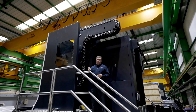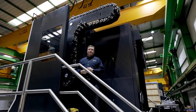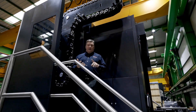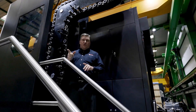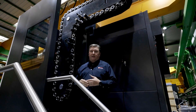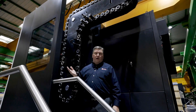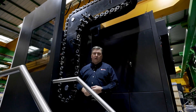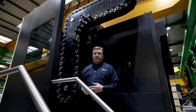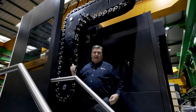This automatic tool changer can change out any head we have in the head changing system — whether it's the orthogonal head, the heavy-duty turning head, the direct milling head, or other heads being used. Tool changer capacities can range from 30 up to 120, and we've quoted more in specific applications. This particular tool changer is an 80-tool capacity.